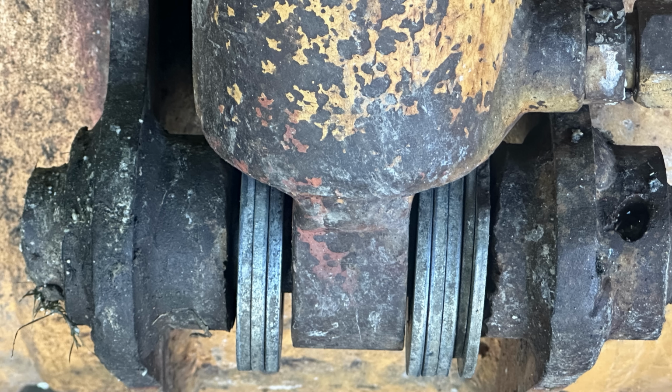And then on top of it, when I hooked it up to a loader to test its functioning, I noticed that there's about 2 inches of slop in the ram on both sides. So both eyelets on both rams are completely worn out. And unfortunately, the bushing, there isn't one. So it's all part of the ram. So short of TIG welding the bore tighter and then reboring it out, which really isn't feasible, or replacing a ram, there's nothing that can be done to fix that.